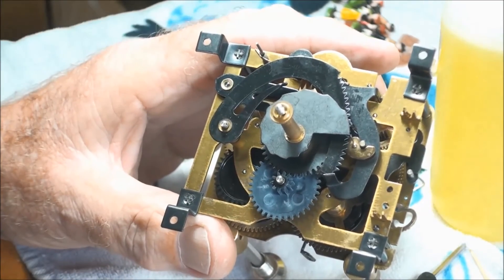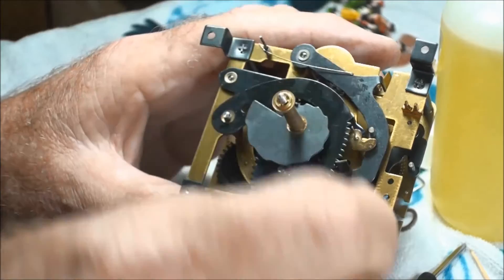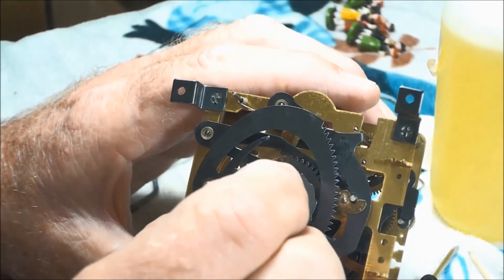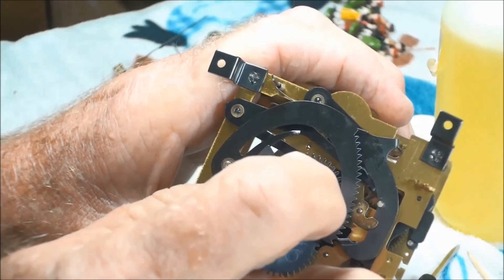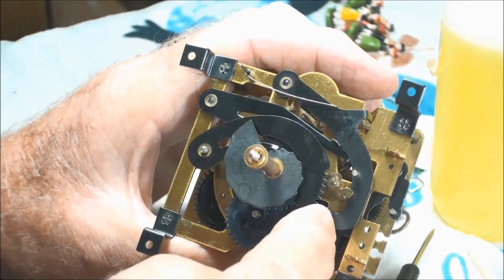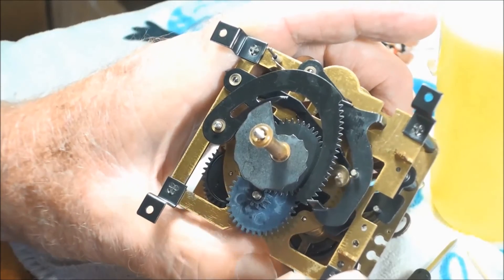There's your half hour. The two-point star down there with the frame on the shaft — the half-hour part of the star isn't as tall as the other end of the star, which is why it only cocks just a little bit to set for the half hour. Here it's dropped all the way so it's going to count the hour — one, two, three. There's a half hour. One, two, three, four — I'm much happier with that. Pay attention to where it's hitting on here because you don't want it too close, otherwise it'll start ringing the wrong hour.